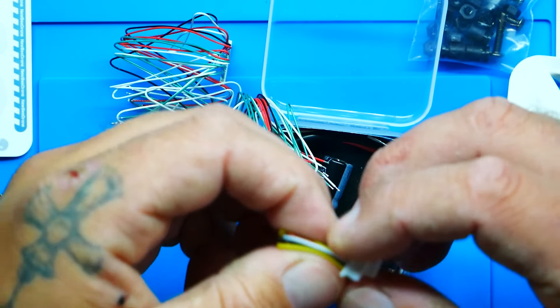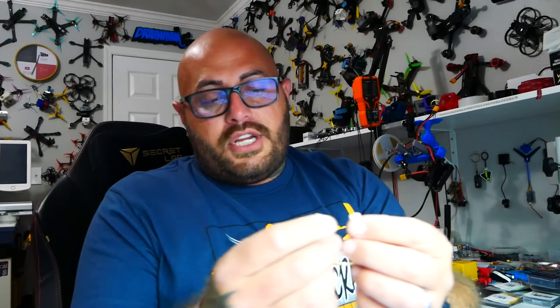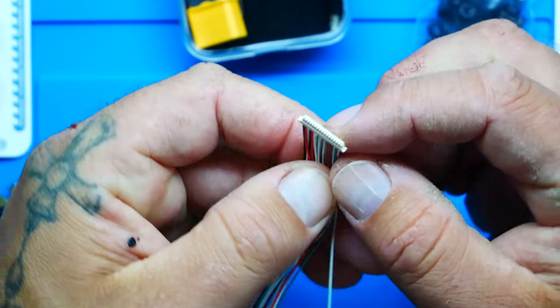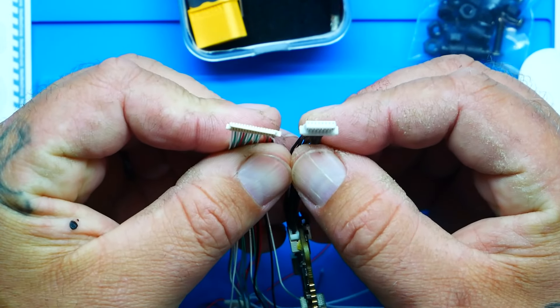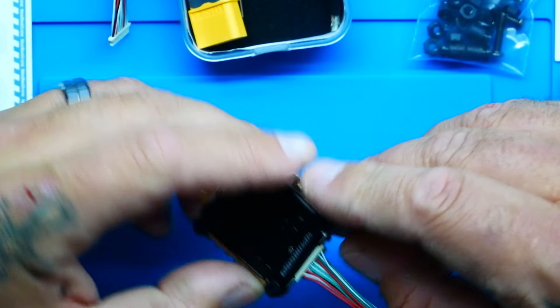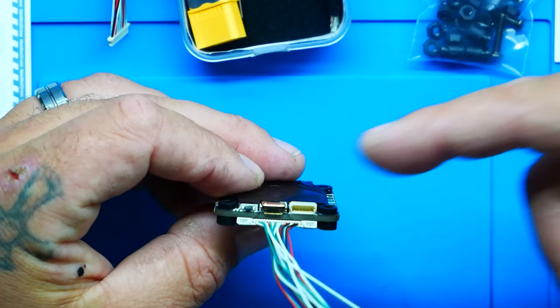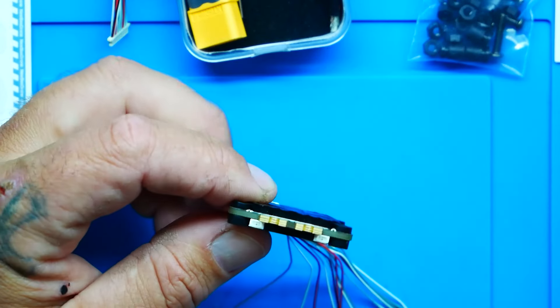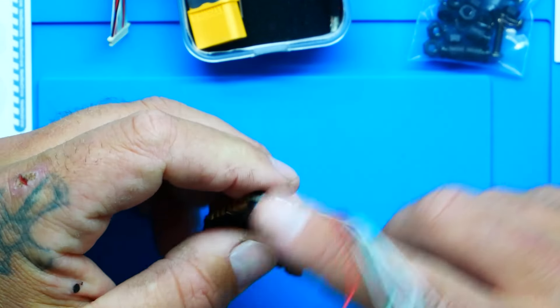This plug here is your DJI plug and play — it's literally ready to go. Plug it into your Infinity AIO, plug into your DJI, and you're off to the sky. If you're running a Vista or something like that, you'll just snip that end off, solder it up, and you're on your way. They left nothing to chance, gave you plenty of length. Look at that — what a difference! Line it up and it fits like butter. Boot, USB, DJI, and all my connections to everything else are all on one side, with just the XT60 on the other.